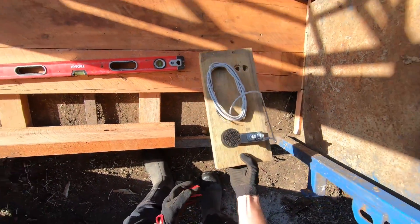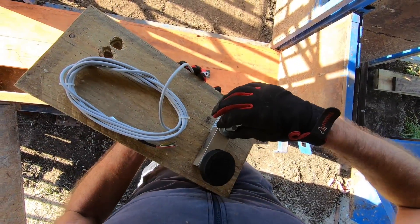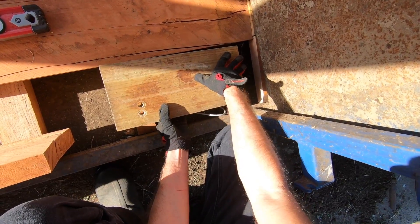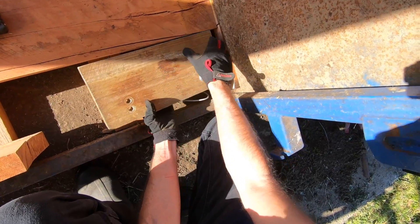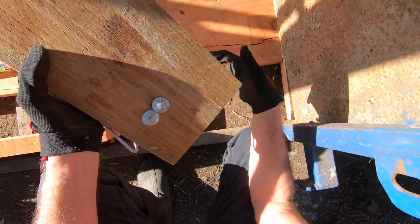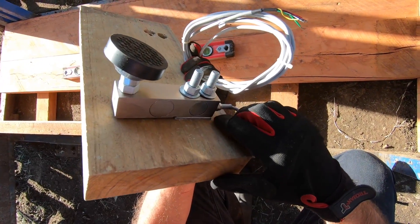Here I've done a little bit of practice drilling my holes with the load cell so I know what it's like. I've got the positioning sorted. It's good here because I can also measure what it's going to be like as far as the height's concerned. I can see it's a little bit high compared to the kit gate platform, so I'm going to want to drop that right down. I've got some test holes drilled at the back, figured out which ones are best, and you can see there's a spacer in there as well.